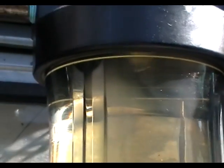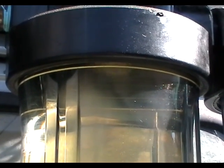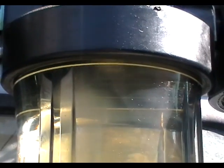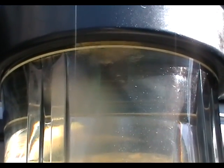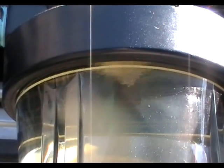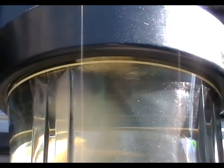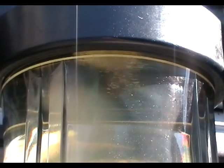The transfer of gasoline backwards through my filtering manifold has been going on for a while. The clear view container that's after the 1 micron filter is still showing fluid entering, which is a great way for me to monitor the progress of this backflushing operation. As long as it's bubbling and churning like that, that means petrol or gasoline is being forced backwards through the filters, and it's great having some positive feedback in this operation. I really like these big clear filters, as long as they don't break like the GE ones did.